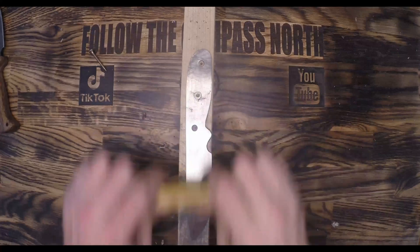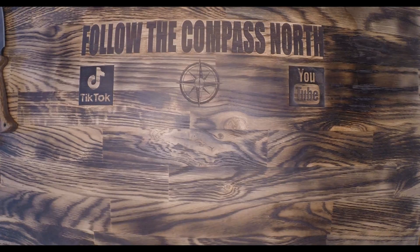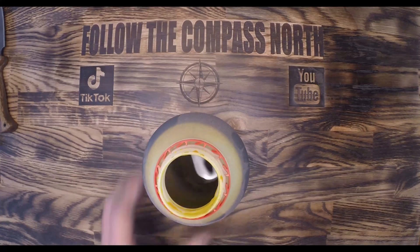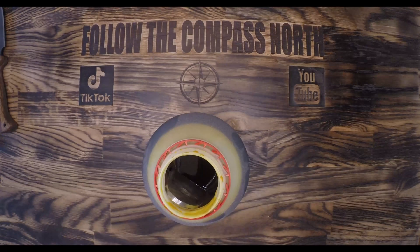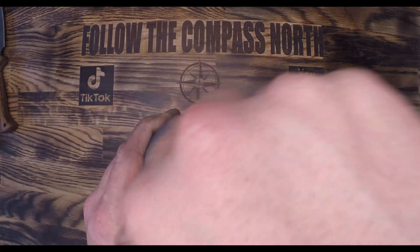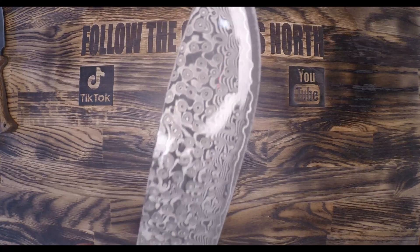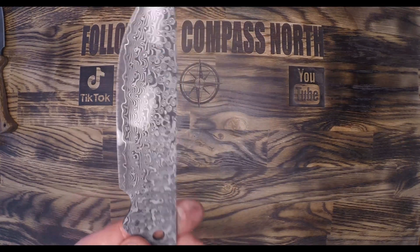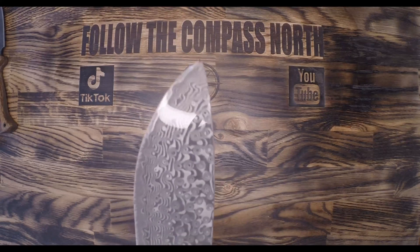The trick with hand sanding is to work your way up to 800 grit all in one direction with a piece of wood backing the sandpaper so that all your scratch marks go in the same direction and are parallel with each other. Wipe the blade down with acetone to get off any oils — oils will resist the acid and you'll have fingerprints all over the blade if you don't do this step. Then we drop it into the 40% ferric chloride acid and let it sit for about 45 minutes to an hour. Make sure you use Windex or ammonia to neutralize that acid when you pull it out.